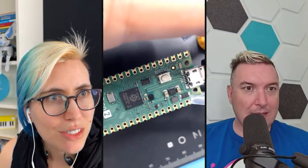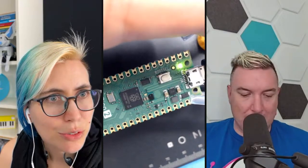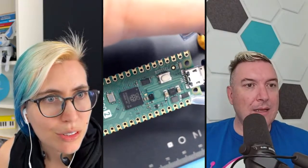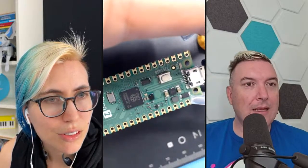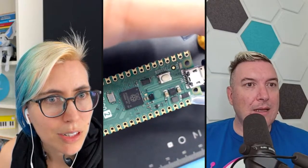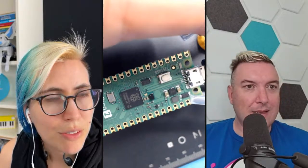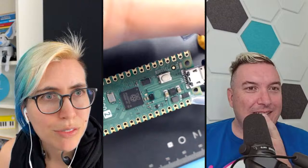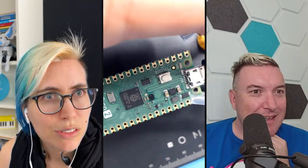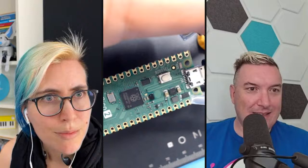It definitely talks to the LED. LED value is true is the first thing that it does with it. And then later on, it's also possible there's something embedded in the keyboard library or whatever that would cause it to do that. But if you're automatically setting it to true when you start it up, then that shouldn't be affecting it. Switches, pins, digital in out. Got pull-ups on the buttons.